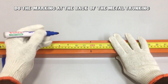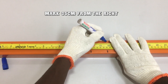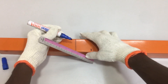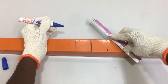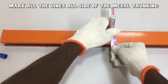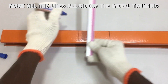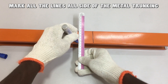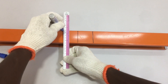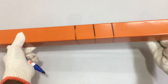After marking the midpoint at 30 cm, from 30 cm mark 25 cm to the left, and from 30 cm mark 35 cm to the right. Now use a ruler and marker pen to draw lines at 25 cm, 30 cm, and 35 cm. After drawing these lines, draw all three lines on all sides of the trunking. All lines must be accurate, with minimal measurement deviation, to achieve a close-to-perfect 90-degree angle. Also draw the three lines with the same measurements on the front side of the trunking.